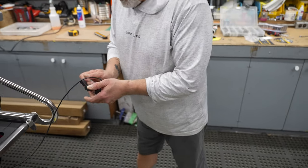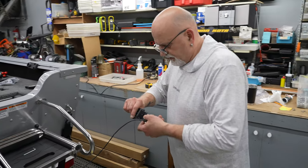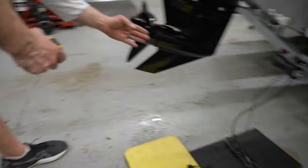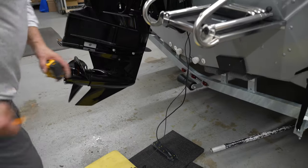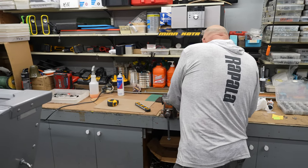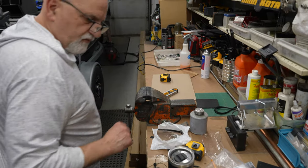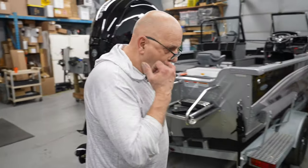Tighten that up. I snap it in, take my pencil and tape. I take the blades of the motor and have them like this - go right in the middle of them and go 15 inches, should be right about there, just on the outside of the bolt. This is for your side and down imaging. It has all the transducers in it, but due to the bottom of some boats we can't get it to dial in to read at high speed. So we use a separate high speed transducer - a lot of applications just don't get lucky enough to get it to work. This way the person's boat will work at high speed and his depth will read.